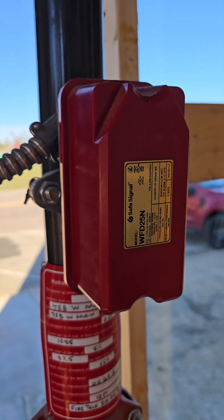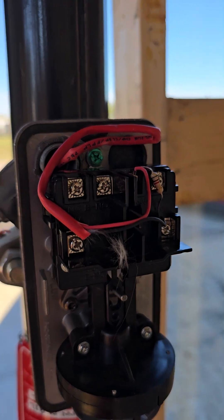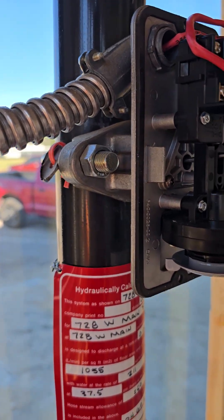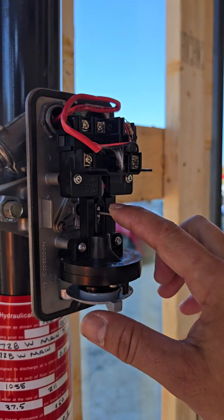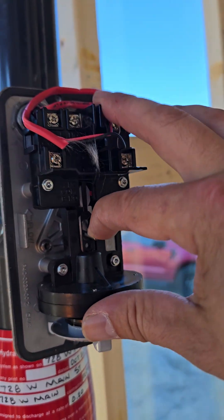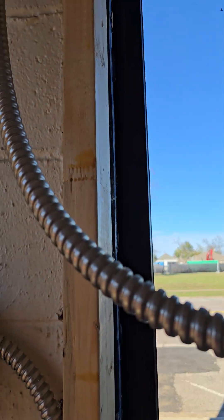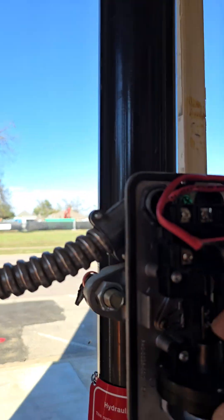What I have here is a sprinkler system water flow switch. Pull off the cover and there's the wire — a trip wire that goes up to a module which is programmed for it. These essentially have a little flap inside, so if water starts flowing, that flap lifts up, and after 45 seconds it will short out these two contacts, which will go up to my module and activate the fire alarm panel.